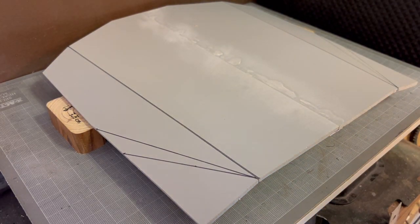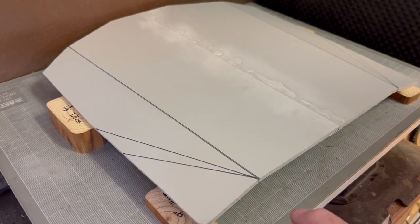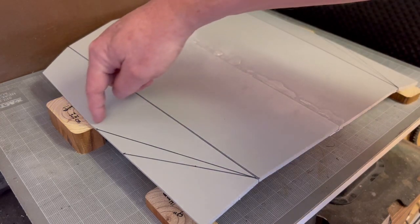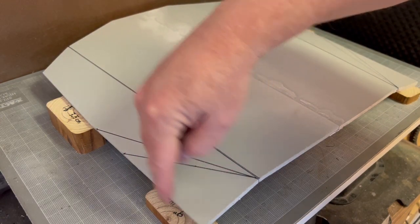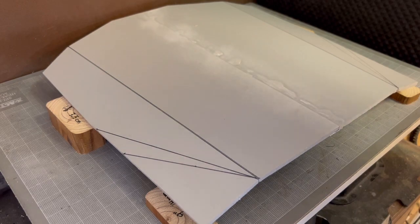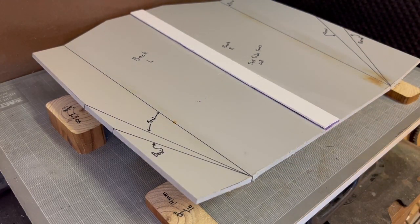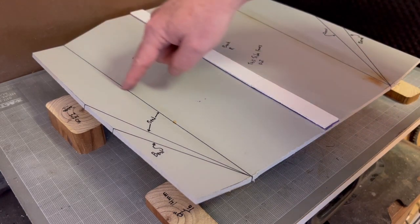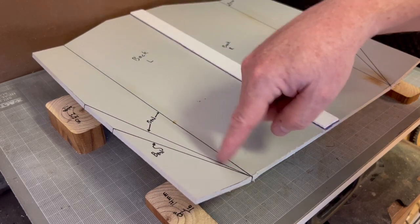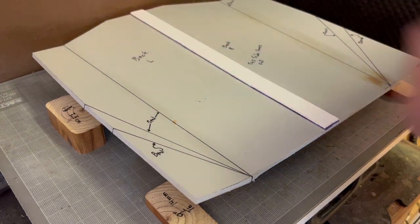Next we have our 9/16 or 14 millimeter pieces. And now we're going to start using these corners here as opposed to this area here, because this now changes directions and is coming up slightly inward. So we'll be using this. Does not have to be super precise, obviously. One of the reasons why we wanted to make sure that this had cooled off is because we're going to heat this section up again, and I don't want this falling down, so I need to make sure that all of this up here that's not going to get heated up again holds everything in position.